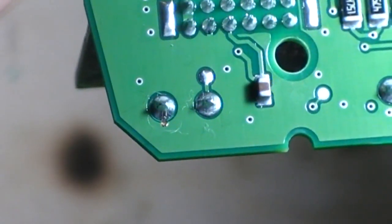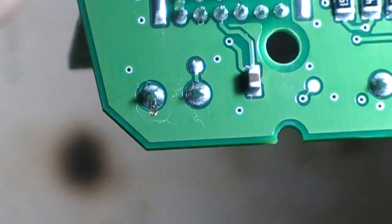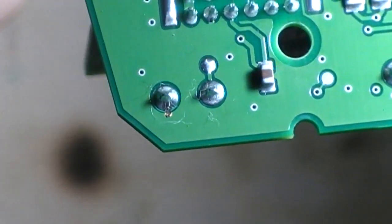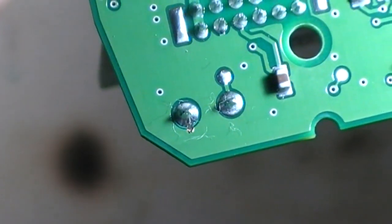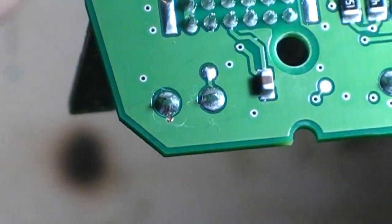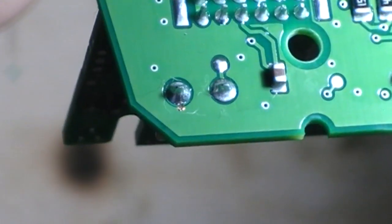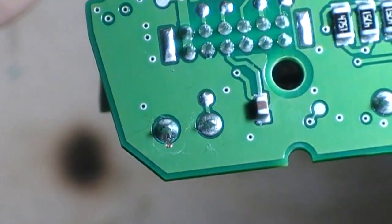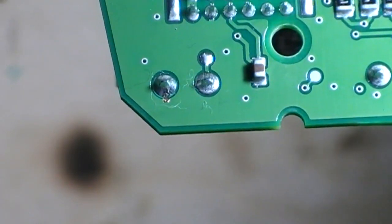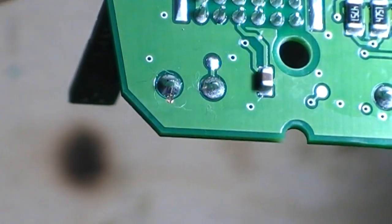You can make out a small copper mark, and if you look at the left-hand pin you can see there's a trace going from the pad to a via. I believe there may have been a trace there that's blown - it's acted like a fuse. As Aaron said, he shorted out the pump. The MOSFET driver has an eight-amp current limit and short circuit protection, but that track can't take eight amps - there's no way. So it needs to go under the microscope.